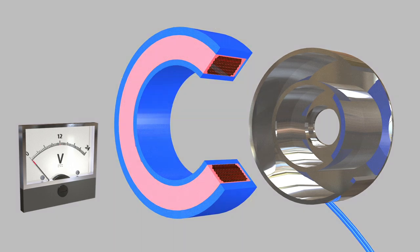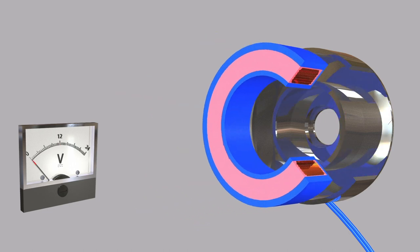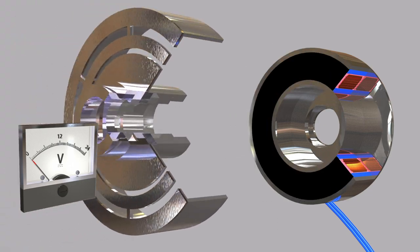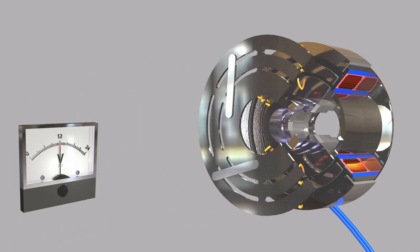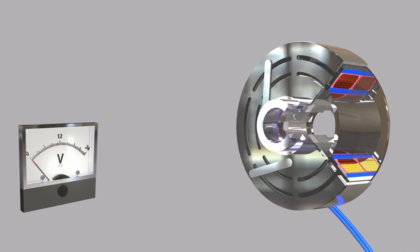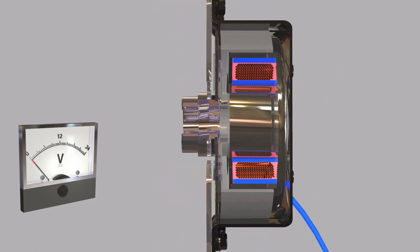When voltage or current is applied to the clutch, the coil becomes an electromagnet and produces magnetic lines of flux. This flux is then transmitted between the small air gap between the field and the rotor. The rotor then becomes magnetized and sets up a magnetic attraction loop between the rotor and the armature. PTO clutch brakes use either a double or triple flux design. So as the flux travels from the rotor to the armature, it makes multiple points of contact, amplifying the torque being transferred, helping to maximize torque and reduce weight and size.